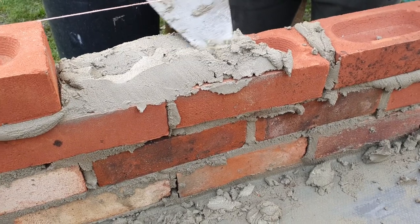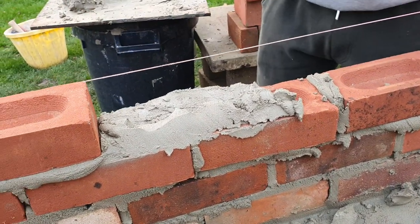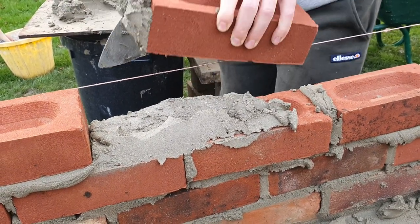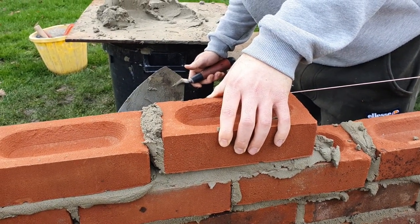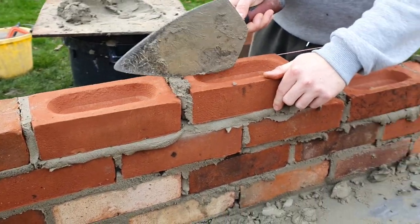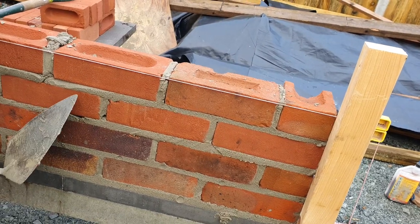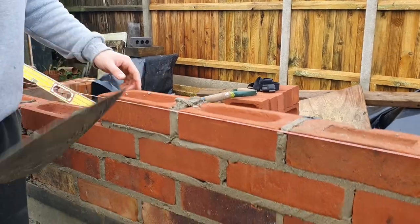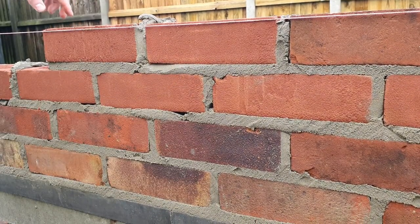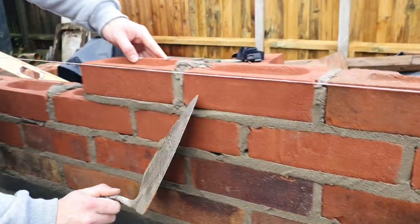Flat, more flat with your trowel. Your trowel, go down a bit more flat. That's it. Yeah. Scrape your snots off and put your cross joint on, and away you go. Yeah. But you don't want to play with it too much. No, but get it down. Get your brick to where it won't go. That end is there. That's right. Okay. Go for your next one, my man.